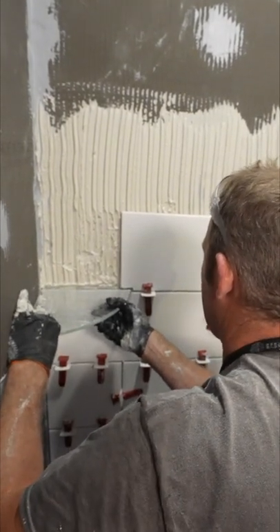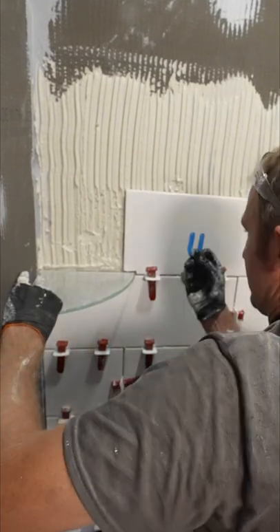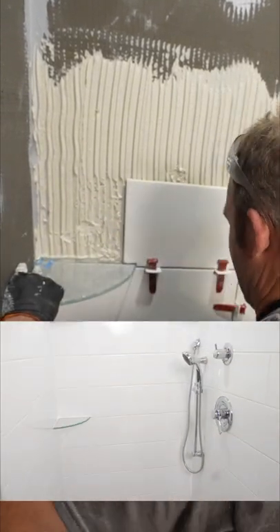As long as that fits in there, I'd like to have a little bit of wiggle room because what we're going to do once I get this other wall up is take some shims and put them on this back edge, because you want this to tilt in towards the shower. You don't want water sitting on the back edge of that.